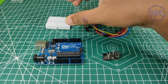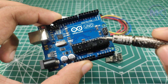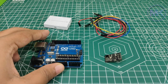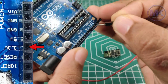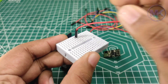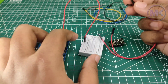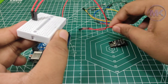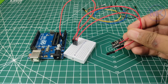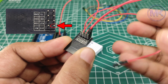To program this ESP8266 Wi-Fi module we need some other components like a mini breadboard and some jumper wires for connections. At first step we need to remove the IC from the Arduino. Take one male to male jumper wire and insert into the 3.3V power supply pin of Arduino, then insert another end into any point in the breadboard. Now take two wires of male to female and insert into breadboard. Connect these wires into the ESP8266 module where one wire is connected to the 3.3V pin and another wire is connected to the enable pin.